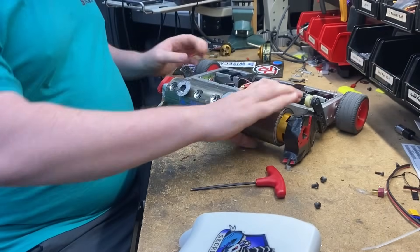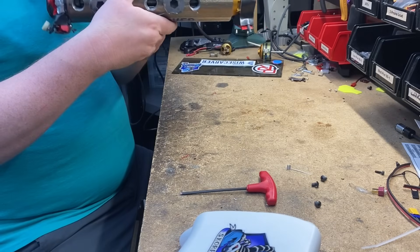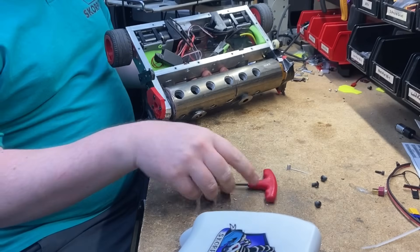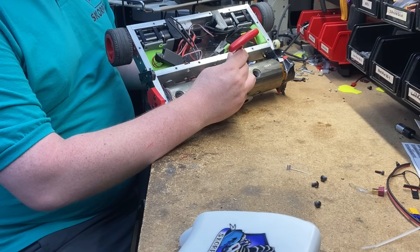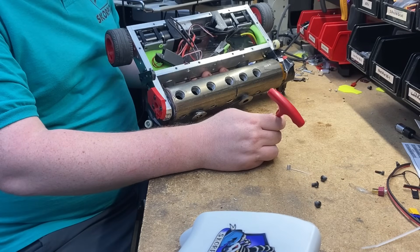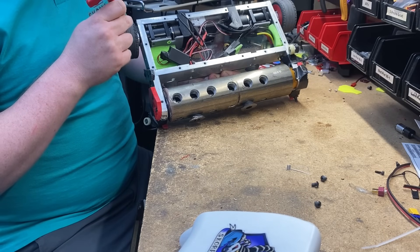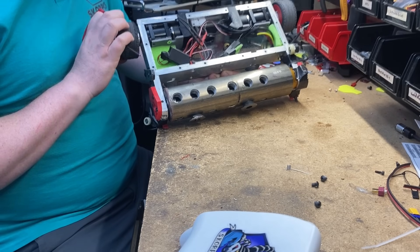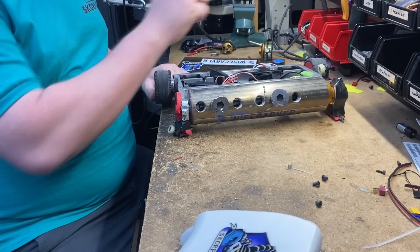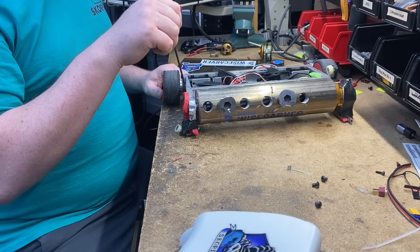My first biggest issue is center of gravity. For those of you who don't know, center of gravity is where the robot balances — if you hold it by just one single point, the robot should stay there. For this robot, its center of gravity is right about here, just behind the drum. The drum is six pounds, and then this frame, all the way back, is another six pounds. With the center of gravity here, it meant this got just as much traction as this. Because traction is how sticky the wheel is multiplied by the amount of weight pressing down on it. When this robot was on the floor, the wheels had about four — maybe five — pounds of weight on them.